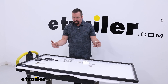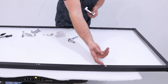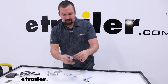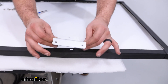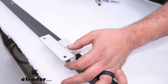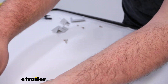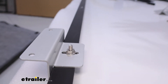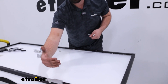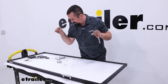To begin our installation, I've flipped our panel over using the foam included in the packaging to protect it. There are holes mounted on the frame and we're going to use the outside holes on both sides - the center one is for a ground. The included brackets are going to mount up with the tabs facing down to raise up the panel, and it's slotted so you can adjust as necessary. The mounting hardware included is a serrated flange nut and bolt, which just takes a 10 millimeter socket and wrench to tighten down. Measuring from the outside edge with everything pushed in, it comes in at 30 and a quarter inches.